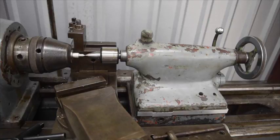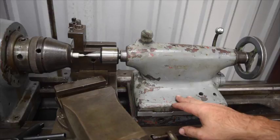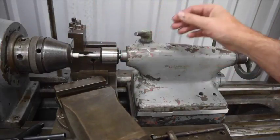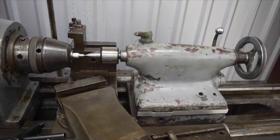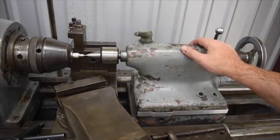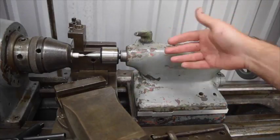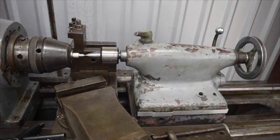So we got a little test fit — got the bottom all put back together, the new parts we made put on. You can see it's even with it clamped, it's definitely on there secure. It's off a little bit to the left — about 20 thousandths or something, just eyeballing it — and it's still just a touch high, which is good, we can still try to mill it down and take a little more off. Now getting this dialed in perfectly is going to be the key, and I could keep loosening and tightening the bottom and sliding this over every time, but I think I want to still try to make a way to adjust it on the fly because it may need adjustment over time.